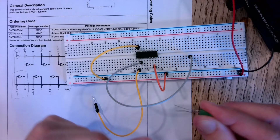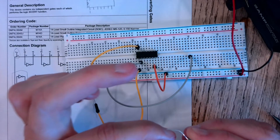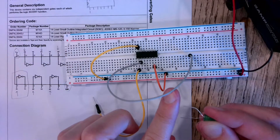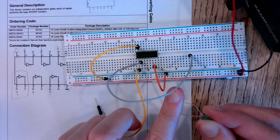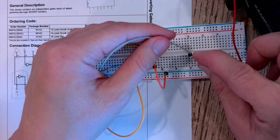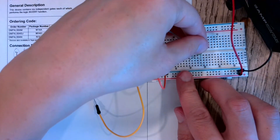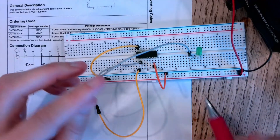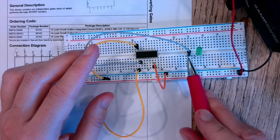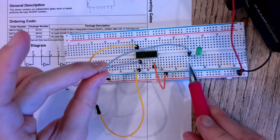What I like to do is bend this a little bit to make kind of a bended knee on my LED — that way the level of these two wires is equal. When I stick it into the breadboard it makes a good solid connection and the LED sits upright.